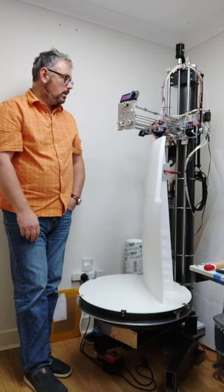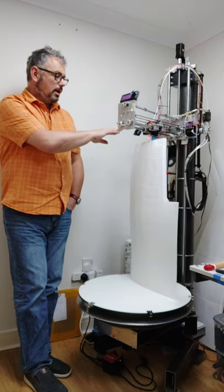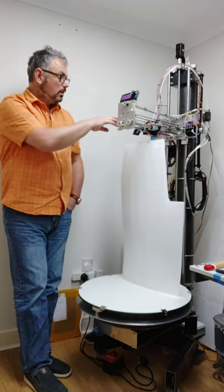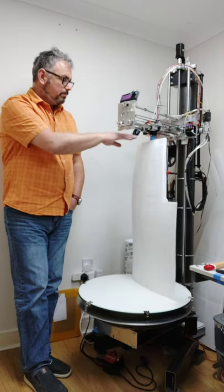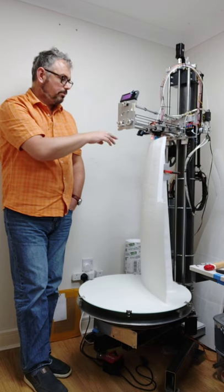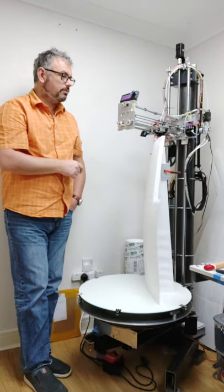The part cooling fan I've got on there is just a gentle breeze — I guess it helps. But I've got some better turbo fans to put a lot more air in. For bridging I can go to 100%, and probably for normal part cooling it will be about 50% on the fan.